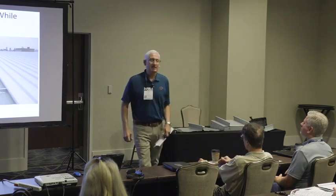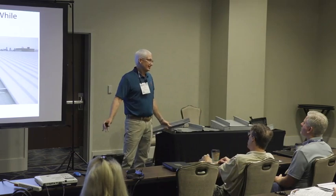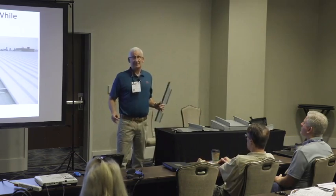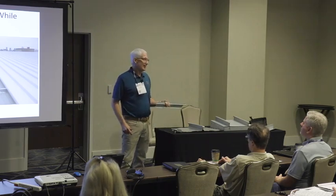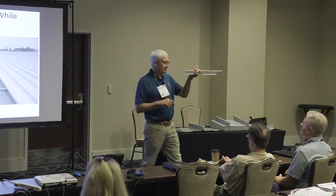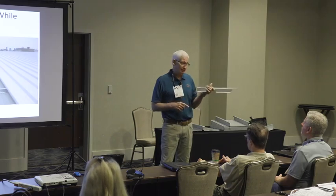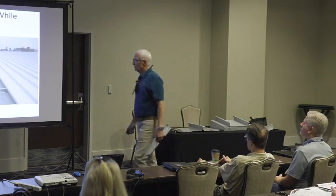I don't know how many jobs I've been on where you got up there before the job was going and it felt like a trampoline. And then after you did the roof, damn, it's solid. So what happened? I mean, it's just science. You're taking a purlin that's 8 inches on the inside of the building, and then you're adding 1.875 inches to it, making it about a 9.75 inch purlin. You're making that purlin taller and you're making it stronger.